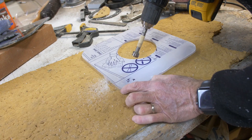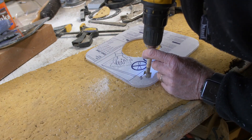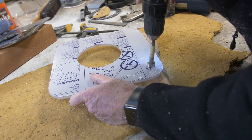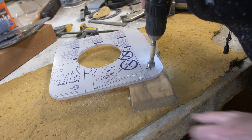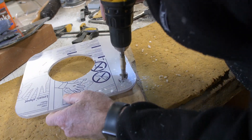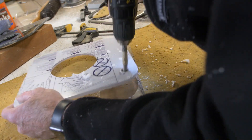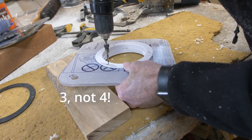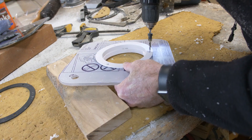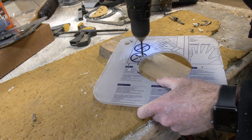Then I mark out and drill the hole for the lock assembly with a Forstner bit, which is not a very aggressive bit — it cuts nice and smoothly. The flange is held down with four stainless steel nuts and bolts, so I drill a pilot hole first, then remove the flange and do the final drilling with the right size drill bit.